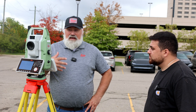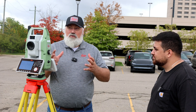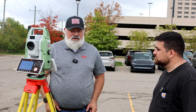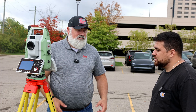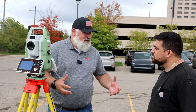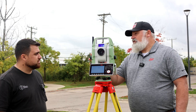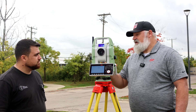It has an optical path and we have built-in autofocus. There is a standard autofocus with a single button click and also continual autofocus — if you hold down the button, it'll continually autofocus, which allows you to point at any prism or any sight you're trying to measure without straining your eyes as much. It's about working behind the instrument, and it's about making that as easy as possible.